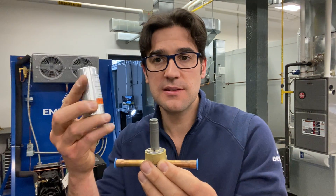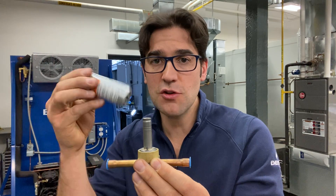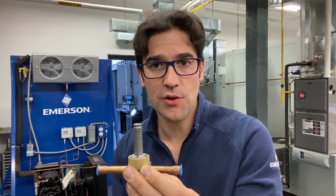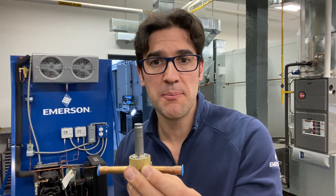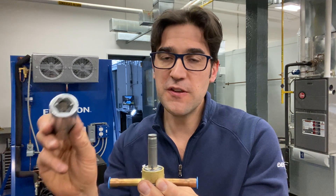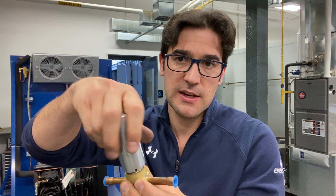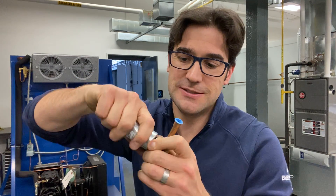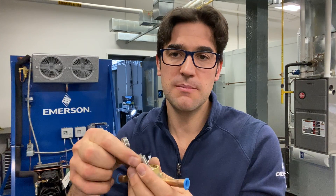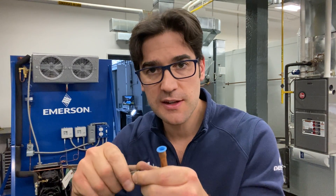But I want to talk about this little magnet that White Rogers sells — super cool. I wish I had one of these. I had an old round magnet that I put on my solenoids back in the day to open them up when I'm evacuating the system. It has a few pins on it, so what you can do is put it on some of the coils and take it apart like that. You can pull it apart to check, to make sure the spring is still in there, and to see if there's any dirt inside the system.